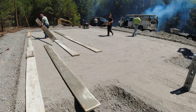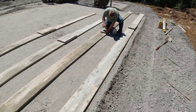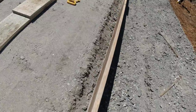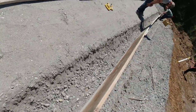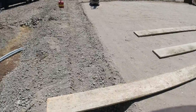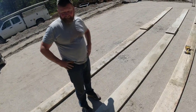When we show up on a slab like this, this is the part of the slab prep that's gone wrong. The builder - the general contractor - hires us, he subs the slab work out to us, and he subs the excavation, dirt work, septic tank, driveway, and slab prep out to the excavator. So when we show up ready to put the forms in, we expect the slab to be prepped properly - level, compacted, good gravel. These thickened edges we call a haunched edge slab or an Alaskan slab; a lot of you guys call them grade beams.